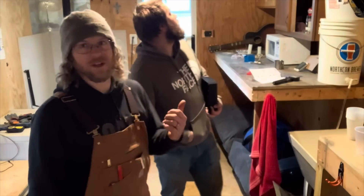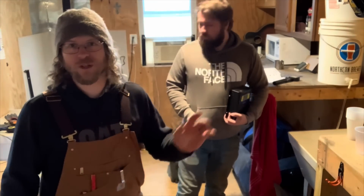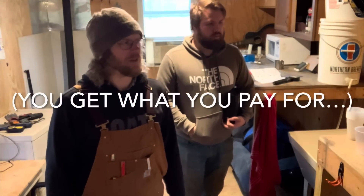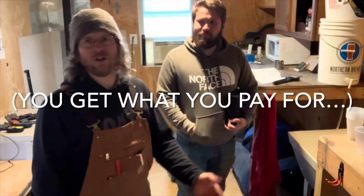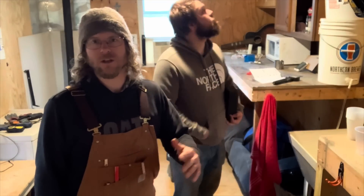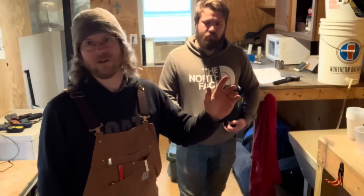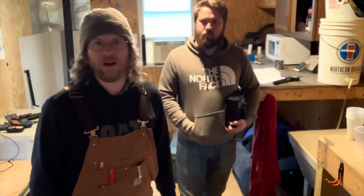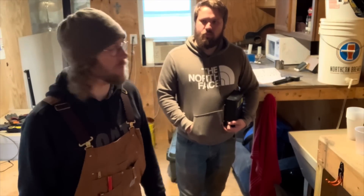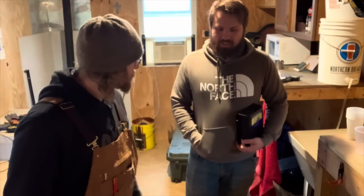When we built this shed system, I got a cheapo inverter, cheapo batteries, cheapo system — and it's not great. It overcharges the batteries; it doesn't stop charging when it should. So I've been having these issues where it freaks out, the alarm goes on, batteries are overcharging, and then it shuts itself off. Which is a good thing it shuts off — because if it didn't, kaboom.